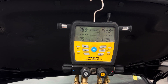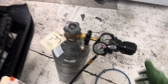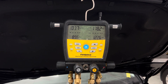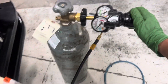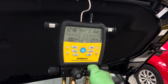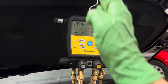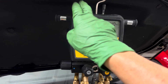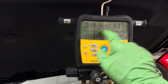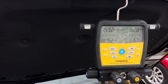This Victor unit valve is really slow when you have it cranked down — let me crank it up a little more. They were at 200 psi on the high side; I just shut off the nitrogen flow so you see it slowly going over. Now, if you have a hard shut-off expansion valve, some of these will shut off and you might have 200 psi on the high side and see like 110 psi on the low side — it'll just stop and might slowly bleed over. A lot of old timers say 'it has to bleed over to the low side; if it doesn't, that means a bad expansion valve' — not necessarily, not if it's a hard shut-off expansion valve.